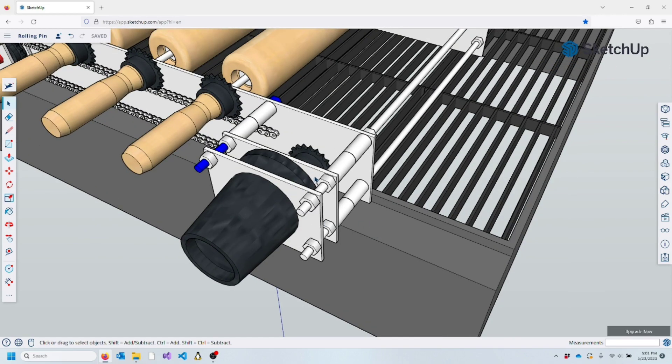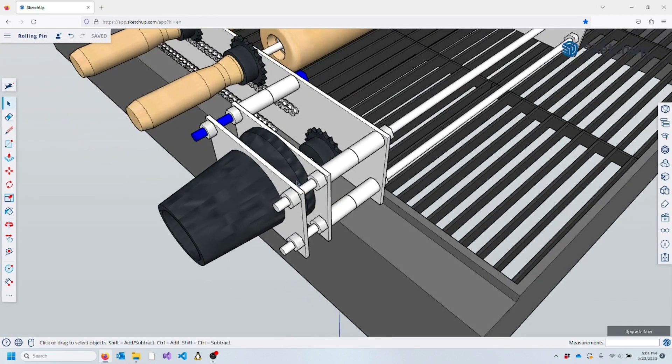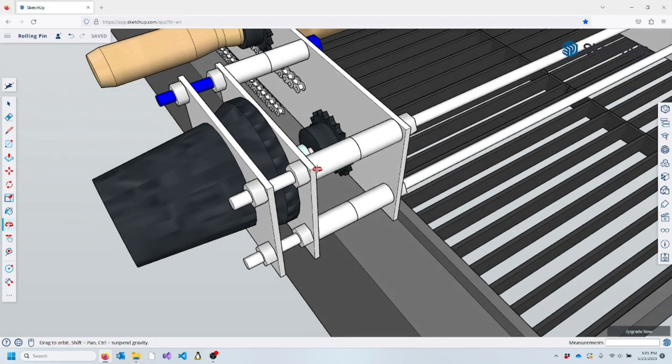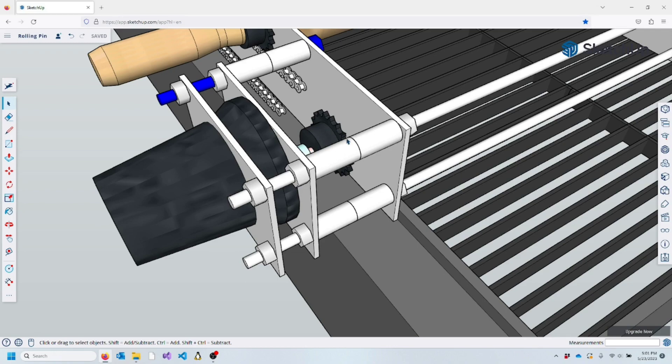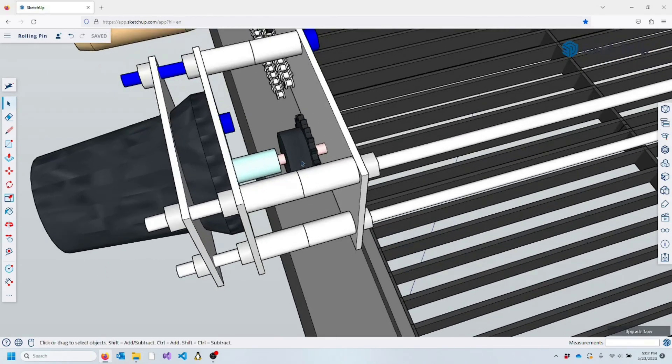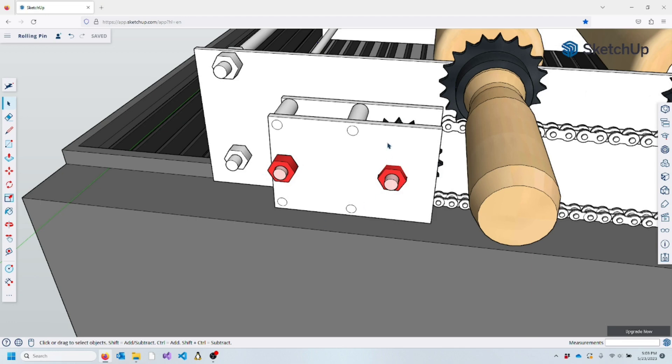The motor assembly consists of two different plates. The front plate holds the motor in place and the back plate has a very large hole in it — a two-and-a-half-inch hole, which scared me a little because that's a big hole. These two plates, once squeezed together, hold the motor firmly in place. Spacers hold the whole motor assembly the right distance from the body of the machine so I have room to mount the axle that holds the drive gear. The motor I selected from Amazon has a larger diameter than my drive gear, so I needed to do a coupling.